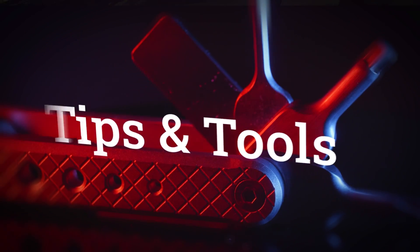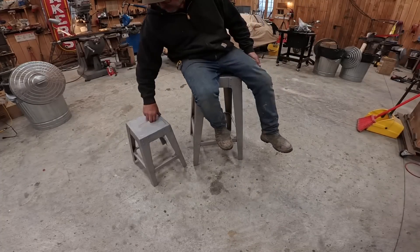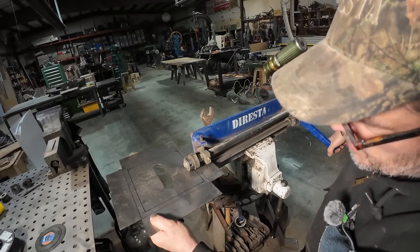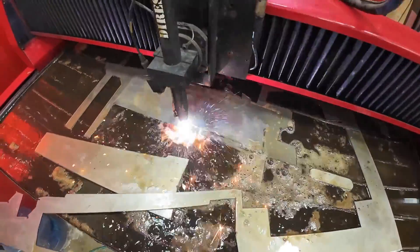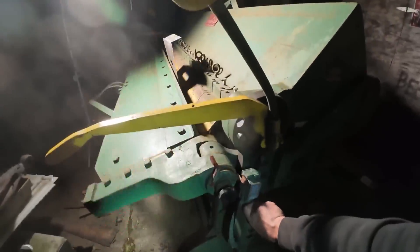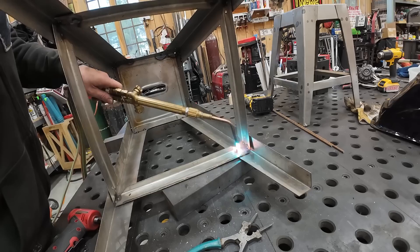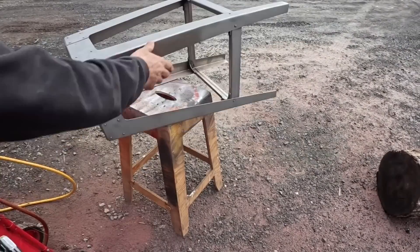Now for some tips and tools. On his channel, Jimmy DiResta shows how he made a pair of steel workshop stools from sheet metal. These are my favorite type of videos from Jimmy because we get to see him figure out some techniques and strategies for the first time. I'm unlikely to find myself in front of a CNC plasma cutter or industrial sheet metal brake anytime soon, but creating scale models, bead-rolling offsets in sheet metal, heating and forming old-school rivets, adding gussets for lateral strength, and using sandblasting as a metal finish — there are a lot of useful ideas here that may come in handy later.